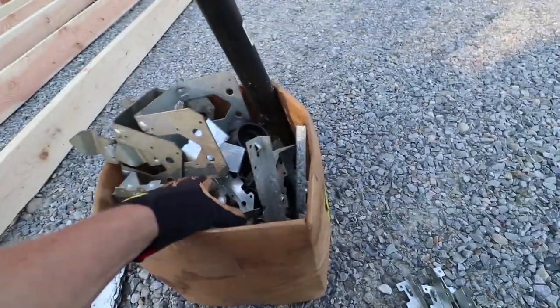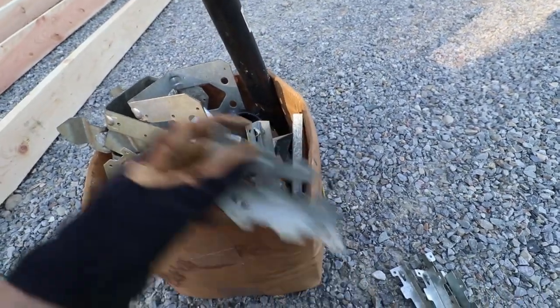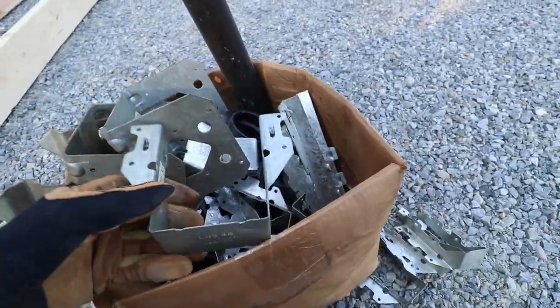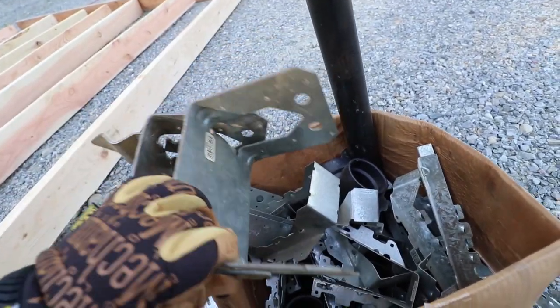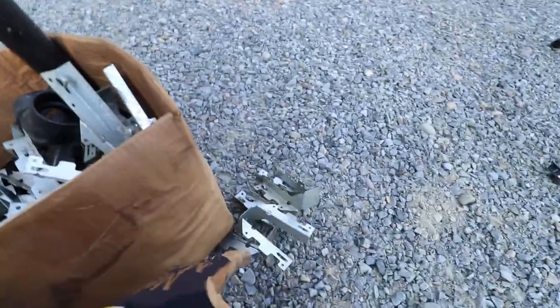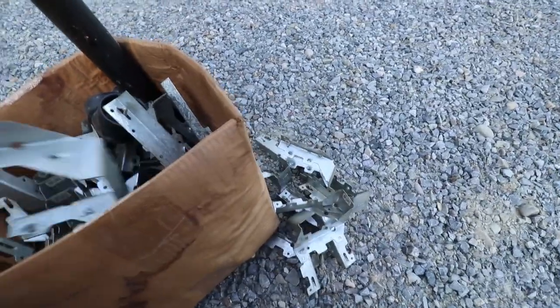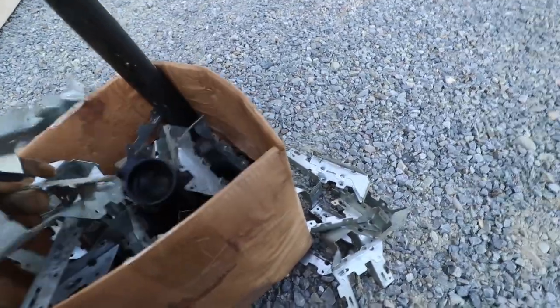Another improvement we're going to make, something I probably should have done the last time, is to put hangers underneath these joists. These hangers we actually got almost 2 years ago through this monster reclaimed materials find we had. We've got all kinds of things, from direct pour-in post holders and bolt-down post holders to 4x stuff, but I think there's a bunch of 2x6 hangers in here. What a great use for these things. Since we're building a timber frame, we're not going to need a lot of this stuff, so it's just sitting around taking up space.